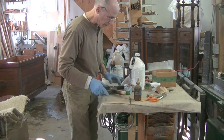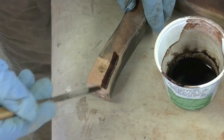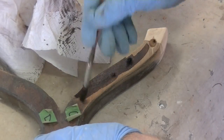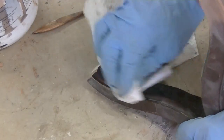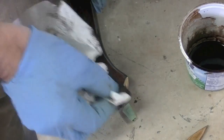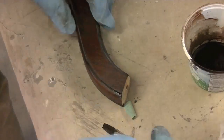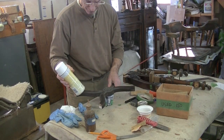Everything's sanded up to 150. I have some extra dark walnut dye stain here. I'll try it on the bottom first to see how it works, then do the rest of it. For the top section, this is the walnut veneer — I don't want it to get too dark, so I'll put a little stain on this paper towel. I've let this dry for a while, so I will seal it with some shellac.